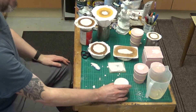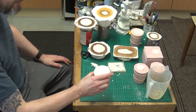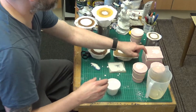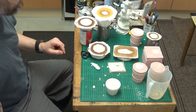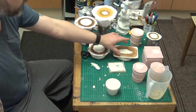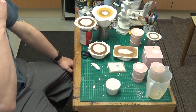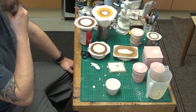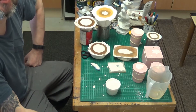I've filled all these molds and I've got a little polystyrene cut there, so we can use that as our tester — our canary-in-a-coal-mine experiment to see how it sets. It's gone off pretty hard. I'm not sure how these detailed molds are going to come out; I don't feel very optimistic about those. Maybe the less detailed and simpler shapes like the candle holder molds and the fossil mold will come out quite good. I had to add about twice the amount of water specified in the guidelines to get a pouring consistency, which will at some level weaken the strength of the plaster.